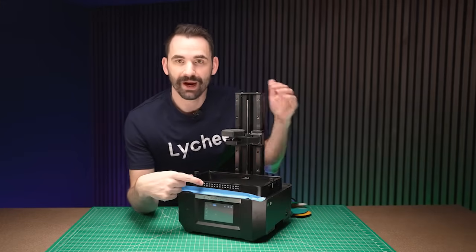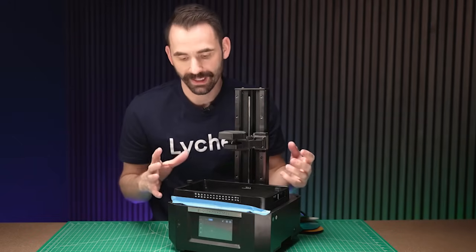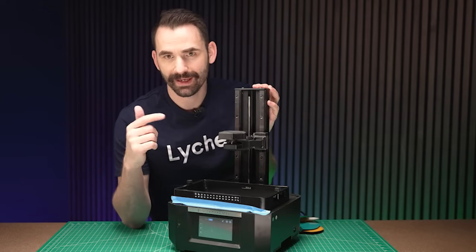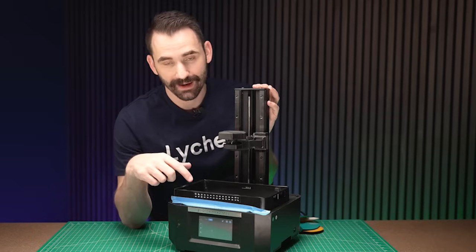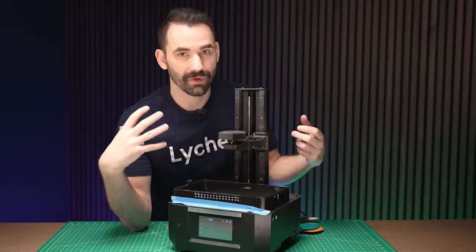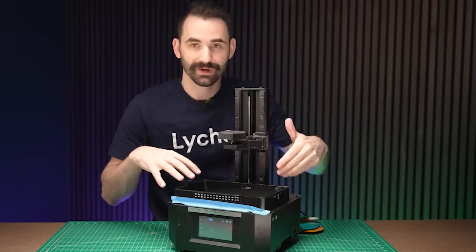You can see why I didn't put the thermometer sticker too low — I want enough room for the tape with the sticker on top. These fish tank stickers are pretty accurate: resin and the aluminum vat are both good at moving heat around, giving a very accurate reading of the actual resin temperature. Most 3D printers don't have temperature readings on the vat itself. Even the new Saturn 4 Ultra 16K has only two pins on the vat connector — one for ground and one for power — with no temperature monitoring pins at all.